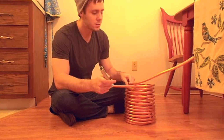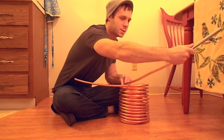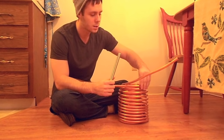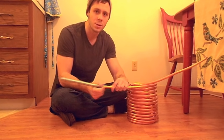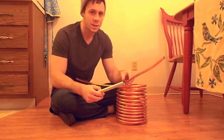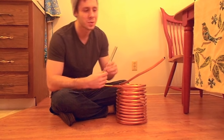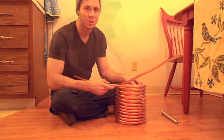This won't fit on the cold water in tubing because since the coil around the PVC pipe was so tight, it flattened it a little bit. It didn't happen on the outside coil, but it did happen to the inside coil. So I'm going to have to try bending this by hand and not kinking it, which I'm not too happy about, but hopefully I don't kink it because it'll suck really bad. It won't ruin it, but it'll constrict the flow, and nobody wants constricted flow.